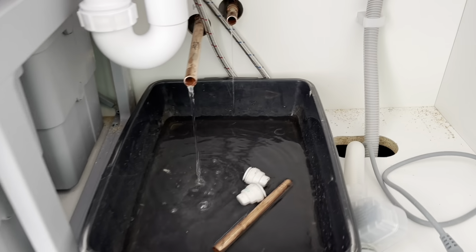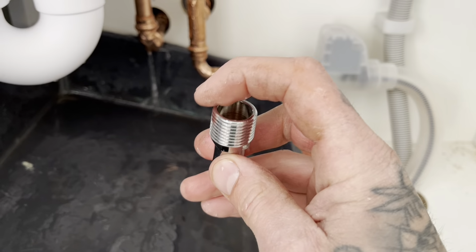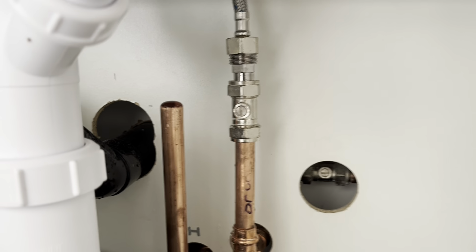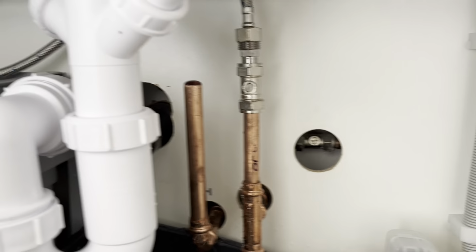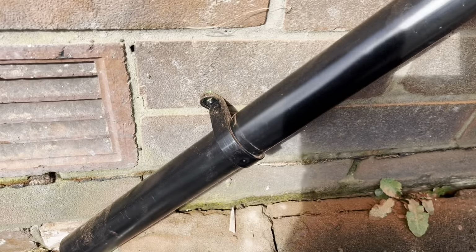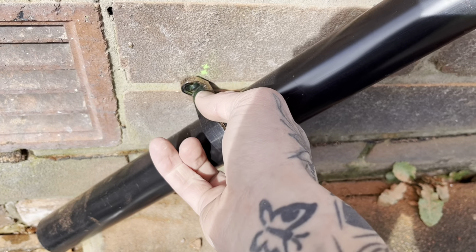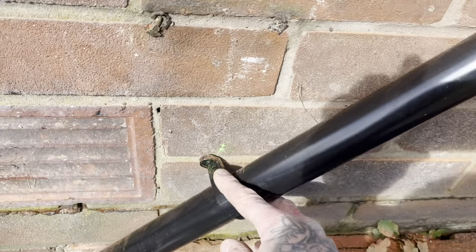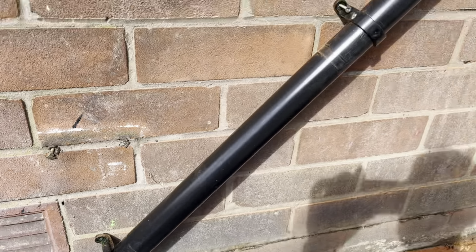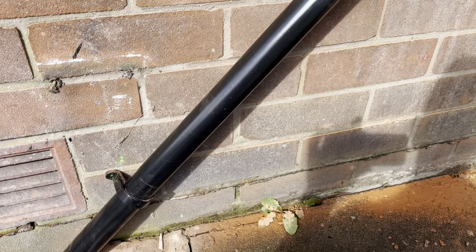If you're watching Today's Tools. I use an isolation valve to get a flat surface for your flexi. Just an old radiator tail. Well, this isn't old, but you get the point. You've all seen the Marksman before, I presume, but if not, perfect for marking up clips. Shoots a little green dart. I did it before, that's why there's two. I'm going to clip out of the way now, drill it. The trace pencil would have done the same job, but looks better in green.